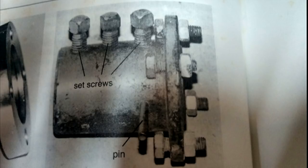Now, as you probably know, to change a Cutless bearing you have to pull the shaft out. The only way you can do that is by disconnecting the coupling from the transmission, which is attached to your shaft. If your boat is, like ours, 30 years old, your coupling, which is made of steel and attached to a stainless steel shaft, is totally welded on. It doesn't matter how you beat on it or pry it, it will not come out. So that's exactly what happened to him.